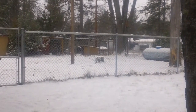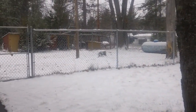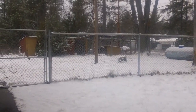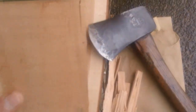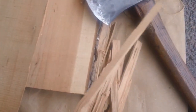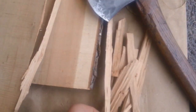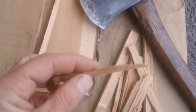Yesterday when I was working on that axe it was 50s Fahrenheit. Today it's a more typical 20 Fahrenheit — that's minus six Celsius — windy, with a foot of snow expected in higher terrain near the lake, so I'm moving inside. I decided to do something else about those gaps. I had this cherry board that was splitting right down the center, so I split off some small pieces to carve down and try to make shims to put into that gap. I'm going to glue one side toward the handle and drive them down as far as I can.